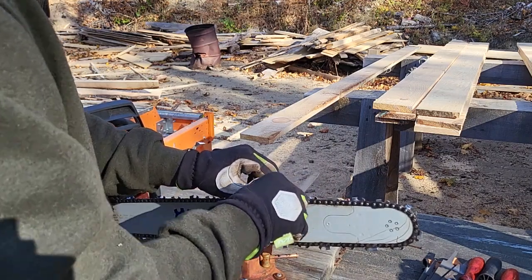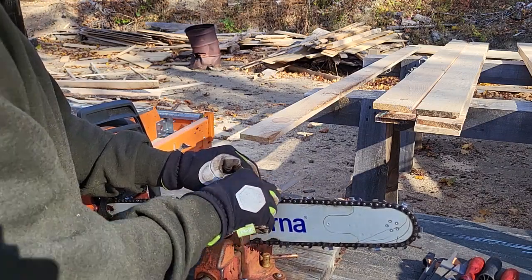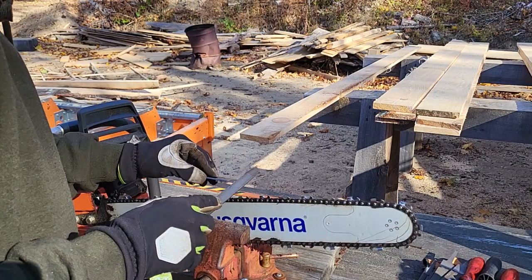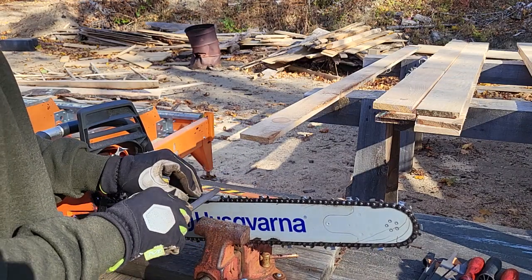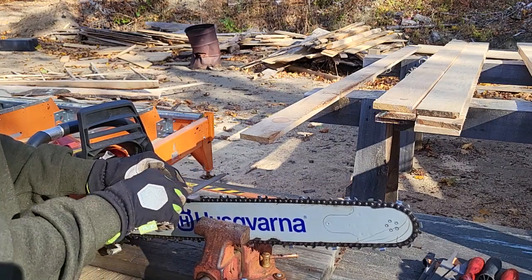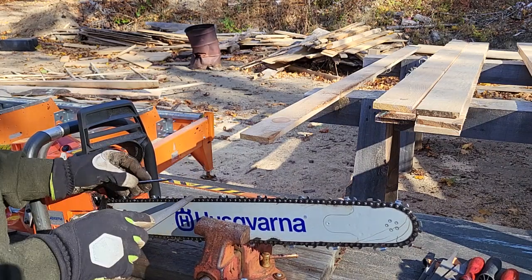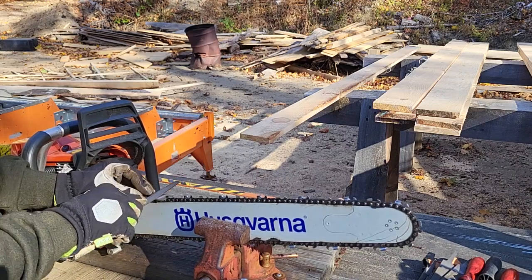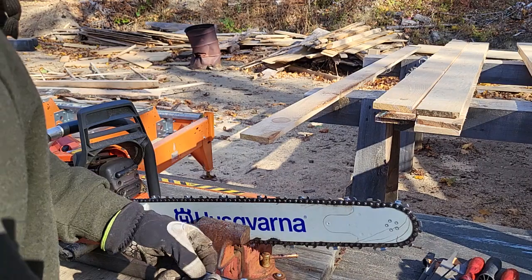Now, I realize that if you're out in the field and you just want to get your saw cutting and you've been doing it for years and you usually just file and take a couple swipes or a drag, then that's fine. And then when you get home that night, you can grind or file your chain, and then you can go around with a gauge and make it right. But doing it by eye is not right. It may get you cutting because it'll get your drags lower than your tooth, which is fine, but it ain't gonna cut smooth because you'll never get them right.